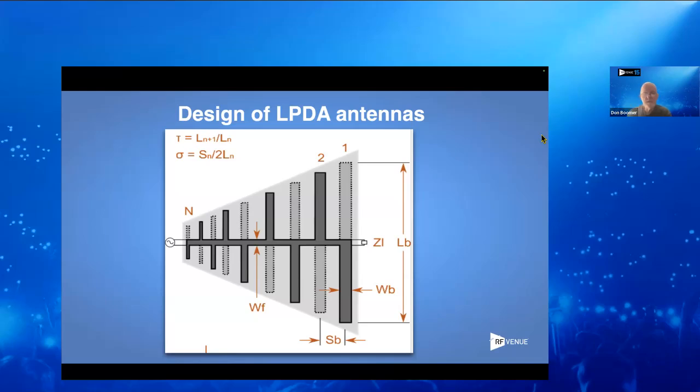So an antenna farm is if you have a whole bunch of receivers and you put their little whip antennas in each one of them and you've got a dozen antennas sitting on your desk, or you've put all your radios in a rack and you've front mounted the antennas and you have a row of antennas. Well, you do create an array, but it's who knows what it's going to be. I mean, the chances of you getting the math right are nearly impossible. So it's going to make some kind of an array, but what you're going to find is that it's inconsistent.